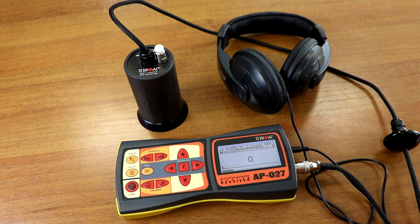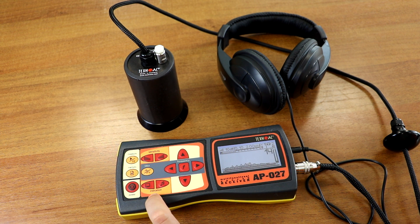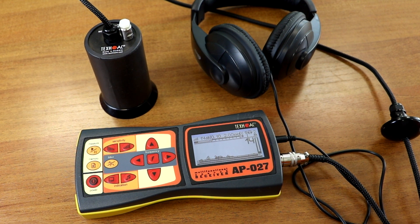In order to locate the leakage, first we have to hear the actual sound coming from below the ground surface. We place the acoustic sensor — basically a ground microphone — above the pipe, then switch the visual indication to spectrum mode by pressing the indication button. In spectrum mode you can see all the sounds recognized by the acoustic sensor. The black segments represent constant noise, while white stripes represent unwanted noise without a constant sound.